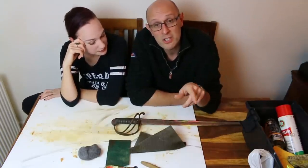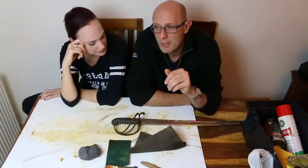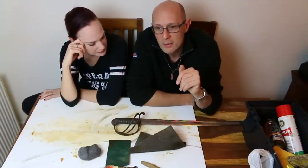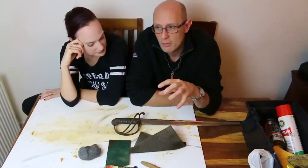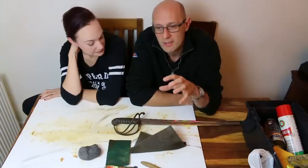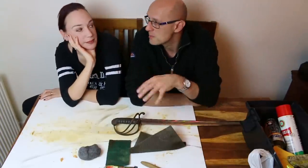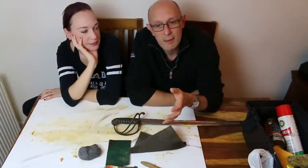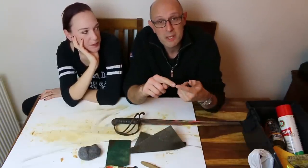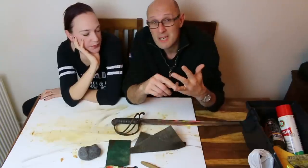And just as I mentioned, I used another type as well, and the other type was a gel. And I bought that from Halfords for people in the UK, so it's for use on cars. For removing rust off, I think, localized areas. And rather than it being a liquid that you suspend the thing in, it's a gel that you smear all over the area and then leave it there. That didn't work very well. I don't know why. I don't know if it's because the rust remover is not so good, or I didn't leave it long enough, or it was a different kind of rust.